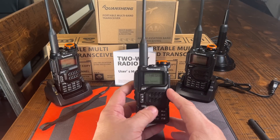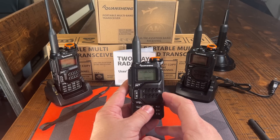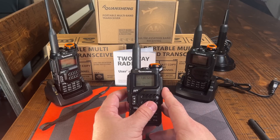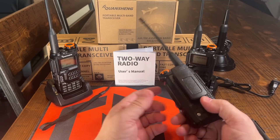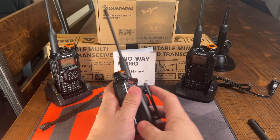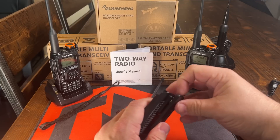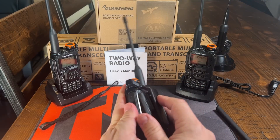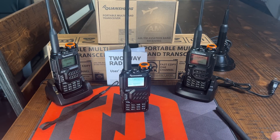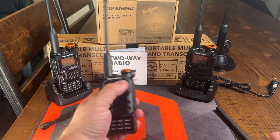Here are my final thoughts on the UVK5. I like the radio. I like the fact that it has air band at the price point. I think there needs to be a little bit of work done to the AM reception, and they need to handle the spurious emissions — I think those are two simple fixes. If they were even to raise the price point by a couple bucks per unit, they would still make the radio worthwhile and we'd have a clean radio. But overall, I like it. I'm picky with the battery — it's a lithium-ion 1600 milliamp-hour. To get the battery off, if you change batteries and want a belt clip, you have to lift that tab, and unless you've got fingernails — which I don't — that is a pain to get off. Overall, I think it's a good start. This is the first version of it. Maybe they'll have some firmware fixes. I don't think that's going to fix the spurious emissions though — I think we're going to need some filters on that. But it was a good start thinking out of the box on things like the AM band and the over-the-air copy.